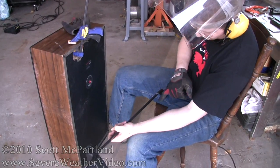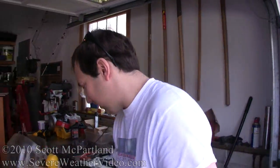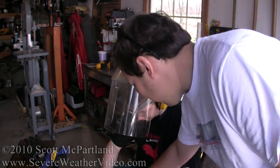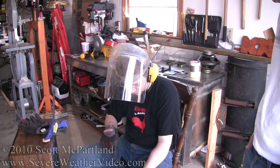I can open this all the way up for now so we can test it — that's probably the best thing. But if you were going to add material to this, if we grind it flat, is it the same as regular steel? The heat-affected zone is going to make weird little hard spots and soft spots.